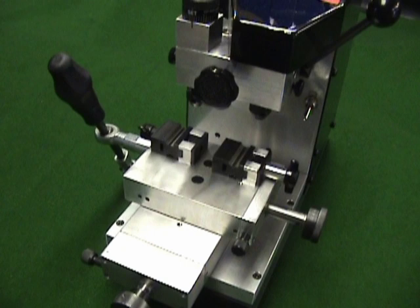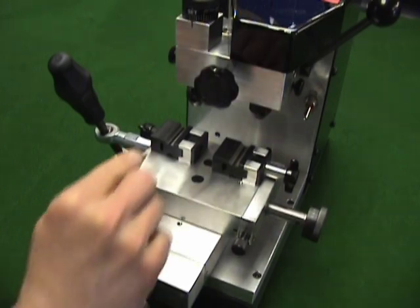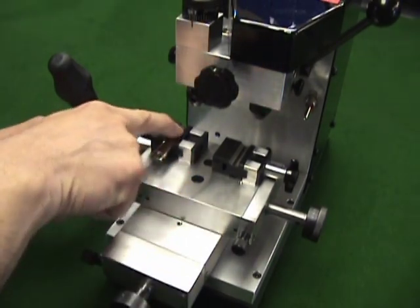In this example, we will prepare the machine to cut Volkswagen keys. The procedure is identical regardless of what type of key you are duplicating. This step does nothing except align the cutter and guide to each other — key type is irrelevant. This step must be done any time a cutter or guide is changed in the machine, or if you change vices, for example turning the vices over from side A to side B or installing a different set. Once this step is complete, you do not have to repeat it for each key you make.